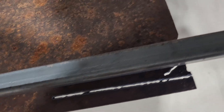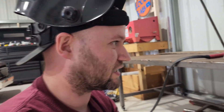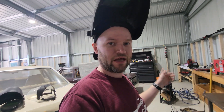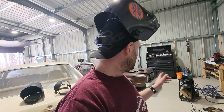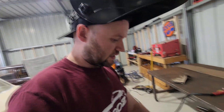Okay, first cut. I did not think I'd blow the breaker that quickly, but so far this thing is cutting very nicely — I was going a little too quick so it didn't cut through perfectly. On the underside there's very little slag, which is pretty impressive considering I haven't messed with the settings at all. Chances are I've got the amperage turned up too high for this thickness, so I'll try turning that down. The issue was actually the air compressor and plasma cutter were on the same breaker — when the compressor kicked on, it blew it. Moved the compressor to a different circuit and got the amperage adjusted.